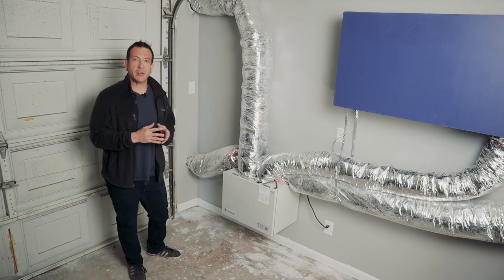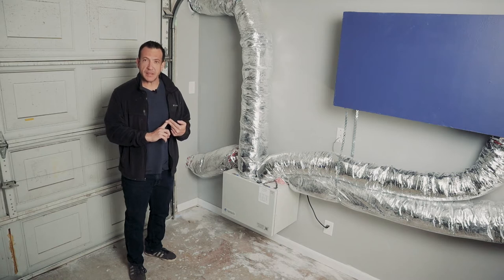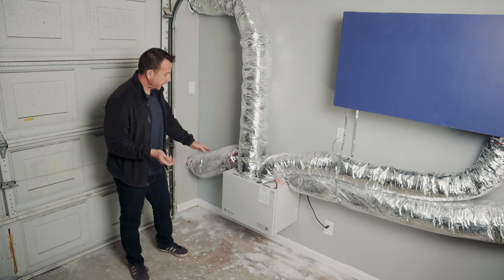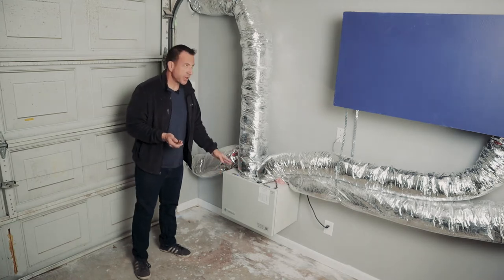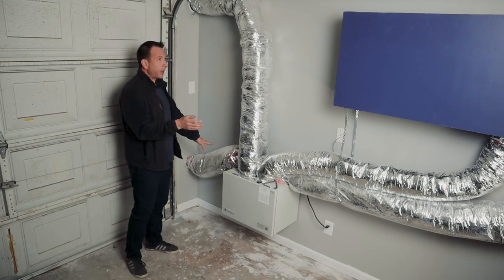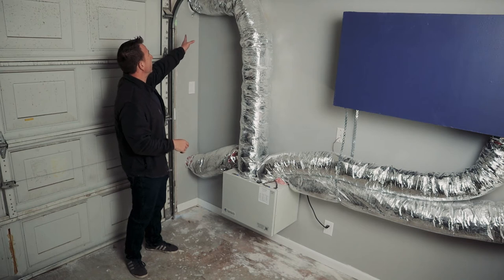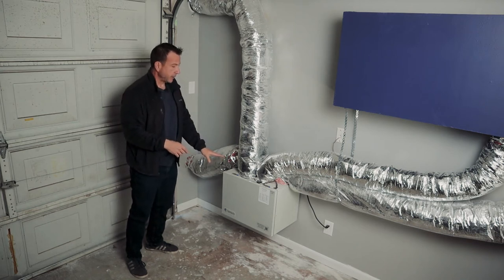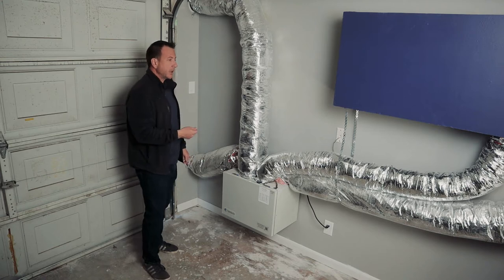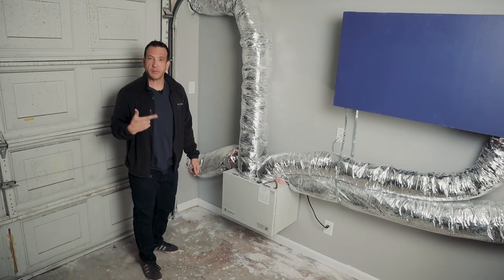When you do all of that, the challenge you can often have is not only how am I heating and air conditioning it, but how am I ventilating it. So what I actually used is a dedicated outside air system, which is this heat recovery ventilator. What this box does is exchange air inside the drum room with fresh air from outside. So here, this is the exhaust. Air is drawn from the drum room through the heat exchanger and exhausted to the exterior. Fresh air is brought from outside into the heat recovery ventilator, and then it's exchanged with the air leaving. There's a tempering, or a transfer of energy, so that the air actually delivered into the drum room isn't the extreme of whatever outside is, either very hot or very cold.